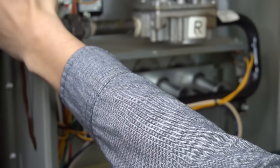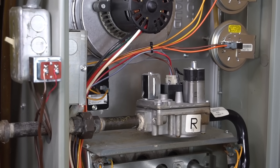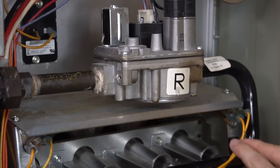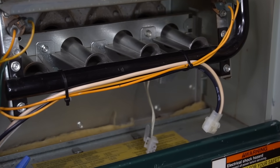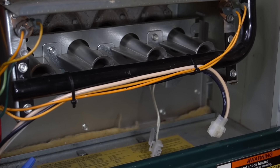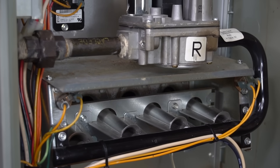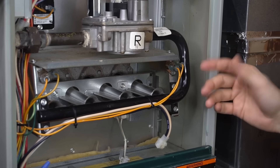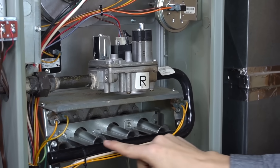So I'll turn my power switch back on and let's see what it's going to look like now. So once again, my inducer motor came on, that closes my pressure switches. And right now my igniter should be glowing, but it's burnt out. What just happened is the igniter did not light the gas — because I have it unplugged, or if it's burnt out — but the gas valve still opened up for a good four to five seconds, letting gas out before it shut back off.